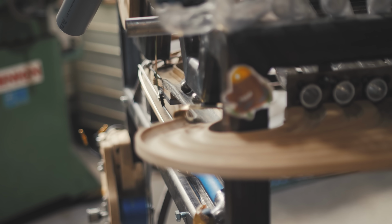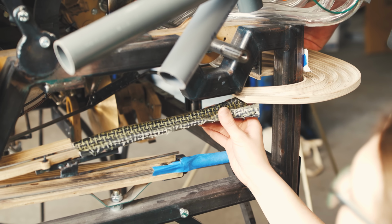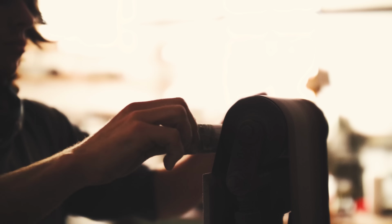And to connect this part back to the tracks, where the tracks are, we had to manufacture another part. So the easiest way to do this was to carve a master model out of foam and then cast it out of resin. So we put some fiber in there mostly for aesthetics, because it will not serve much purpose